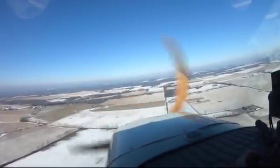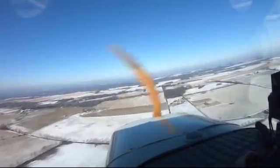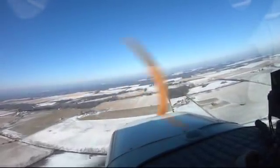If you actually cover up your cowling, kind of like I did before you leave your hangar, you could cover it up with a blanket, put plugs in the front, everything like that. It holds that heat in. Once that element starts heating up and everything, then man, you can really get these airplanes kind of toasty and nice and preheated really well.